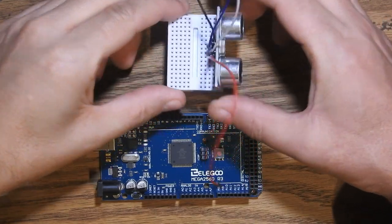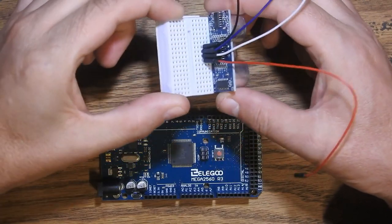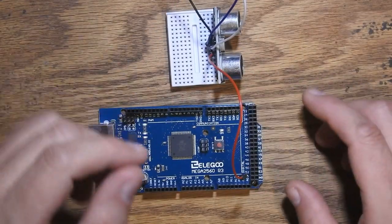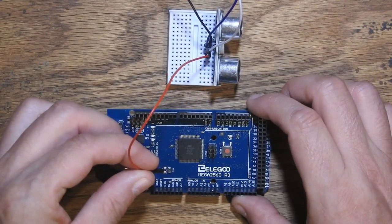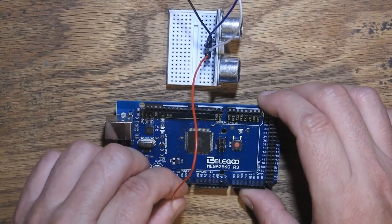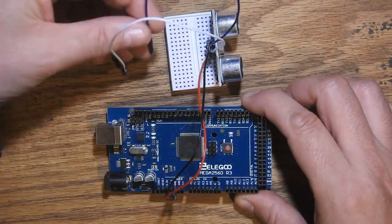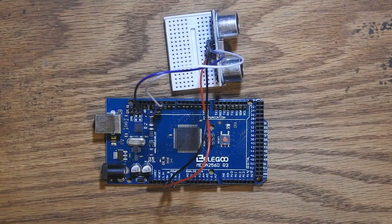So let's build this and see it in operation. I wanted to have this anchored on something so I put it on the breadboard. Let's hook up our wires — red to five volts, that goes to VCC, which is five holes in from the end.